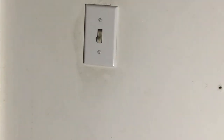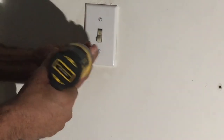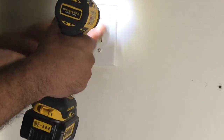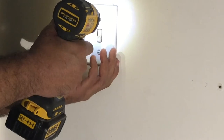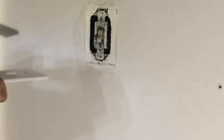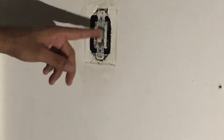The first thing we have to do is get this cover off — two flathead screws. I'll use my driver because it's faster. And there's the switch. As you can see with the new switch, the screws are already attached and they're Phillips head. The older switch is flathead because nobody used Phillips screws a long time ago. You can see how old this switch is.